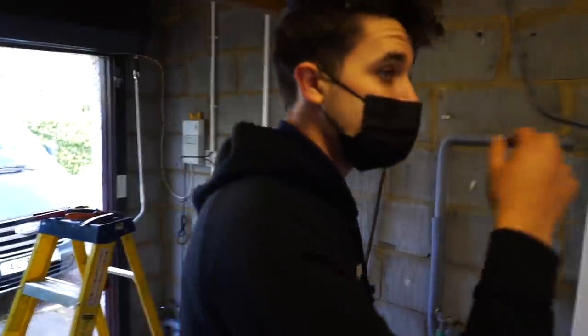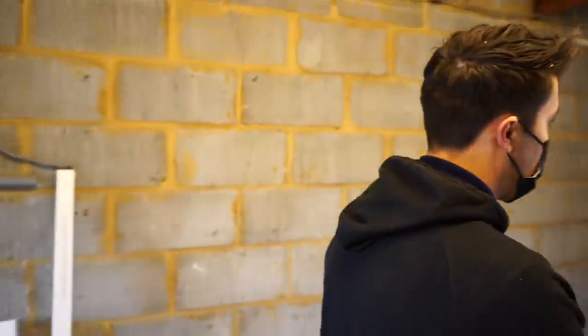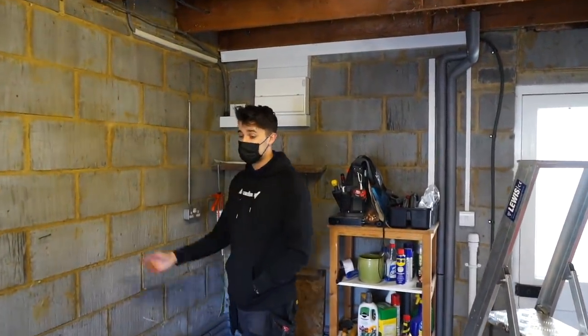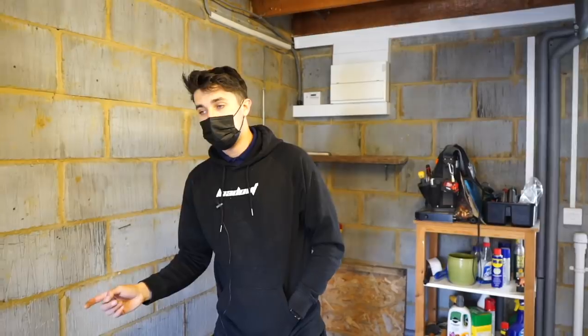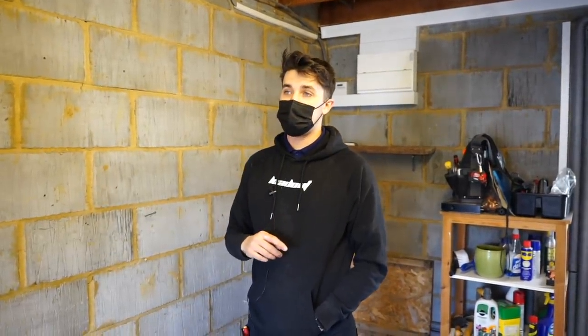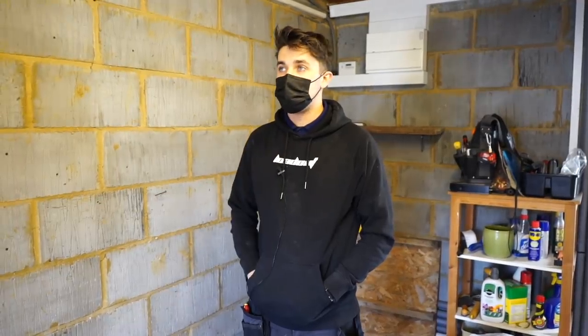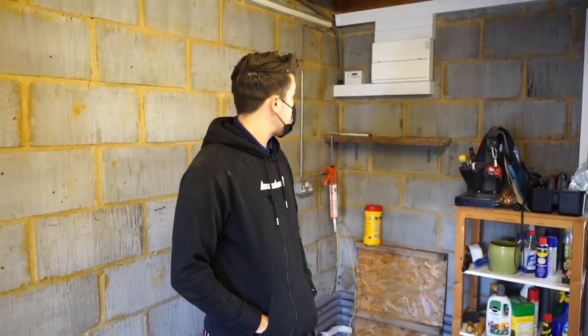We've rewired the lighting circuit in here. So now the two-way lighting actually works. Reconnected all the sockets, reconnected all of the lights next door, pulled in the fan supplies, rewired the supply to the lights next door because it was knackered. We've done loads. It's one where it probably might not sound that bad, but just getting it actually in and wrapped up and figuring out what was going where was just a mission.